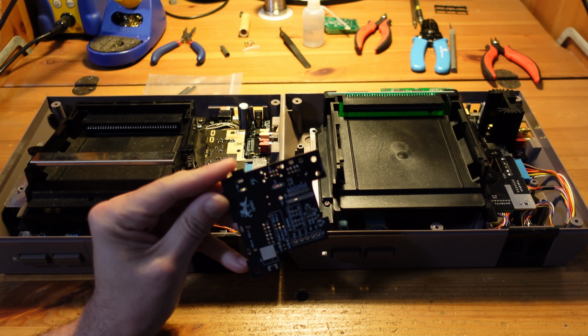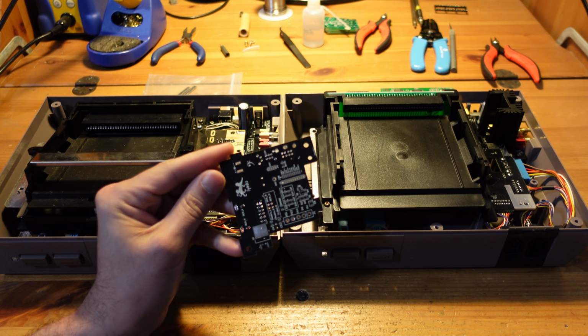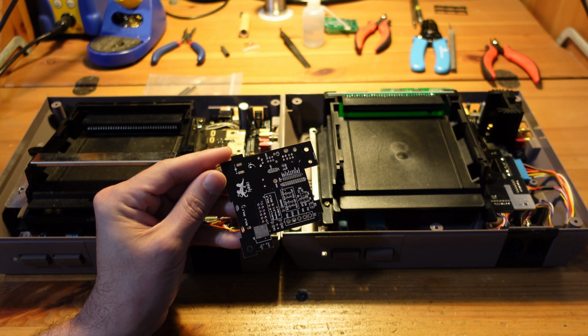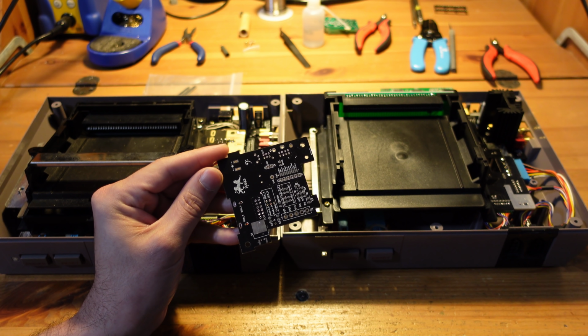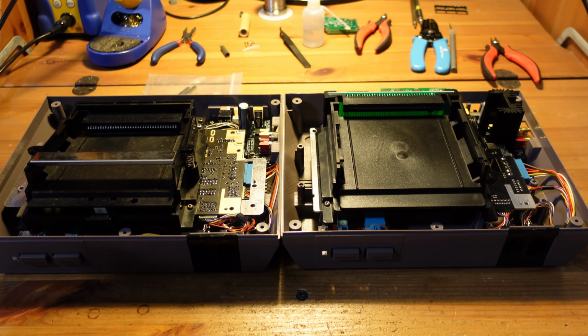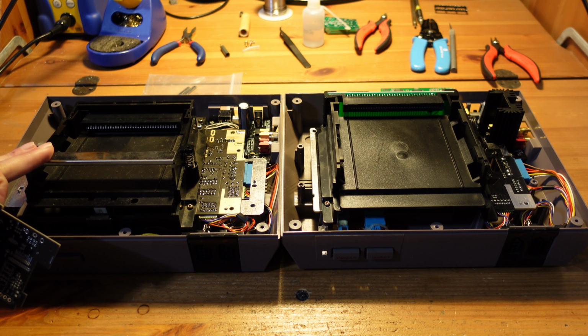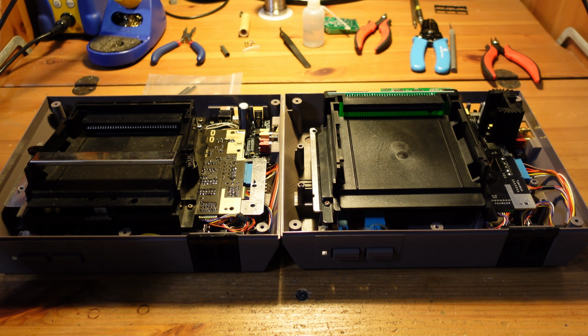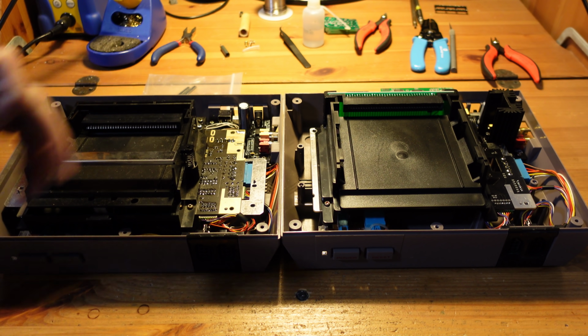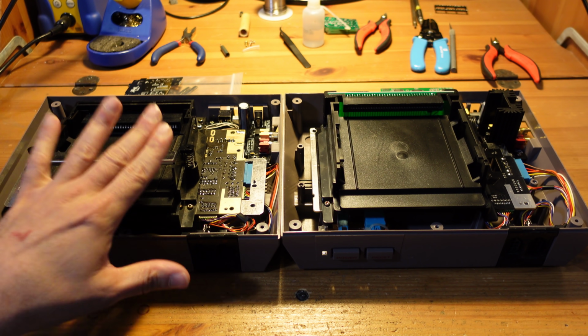And so there was an open source project that I found, although it wasn't complete, it had some errors. So I've learned a little bit since then about PCB design, and I made a few minor changes to make this operational. And not only that, I've combined it with an NESRGB mod, which allows you to have the highest quality video, namely RGB, coming out right over here from this port back here. So we're going to be going over this.